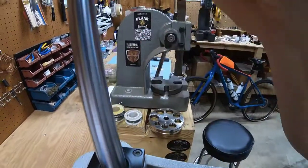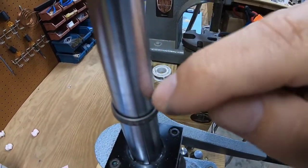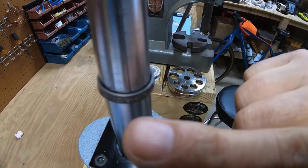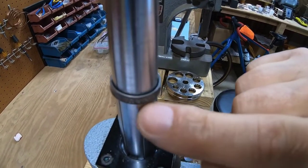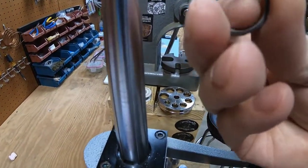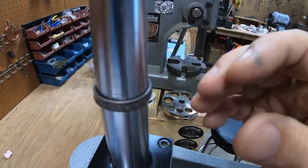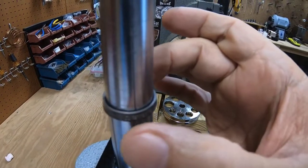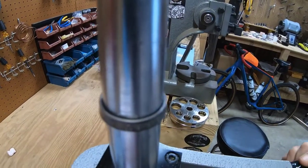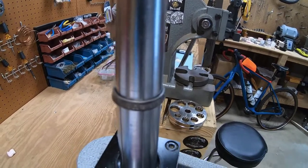And if you look, if I turn the ring upside down, now I have a gap between the bottom of the ring and the stretcher. The only thing that's contacting the mandrel, the stretcher here, is really the reeded side. So if I stretch now, I'm really only stretching part of the ring. I'm only stretching that reeded side until the bottom makes contact again. So I go stretch here. I just stretch easily. You can see it dropping down.